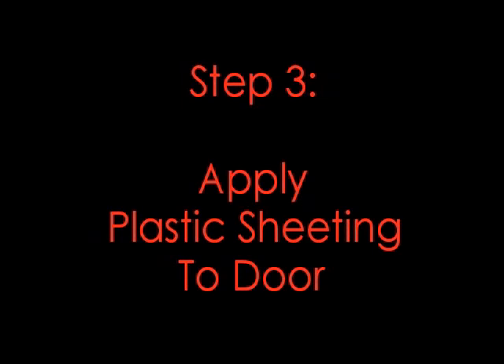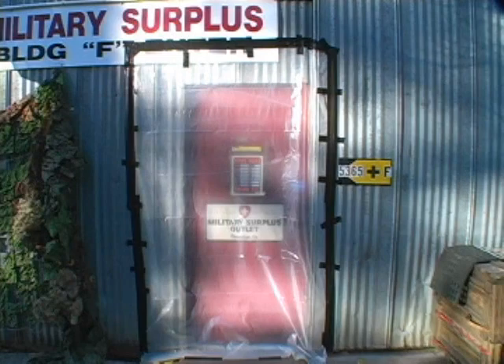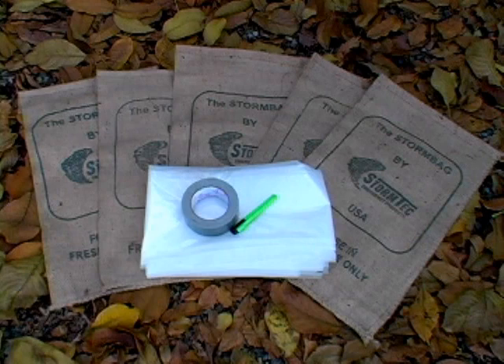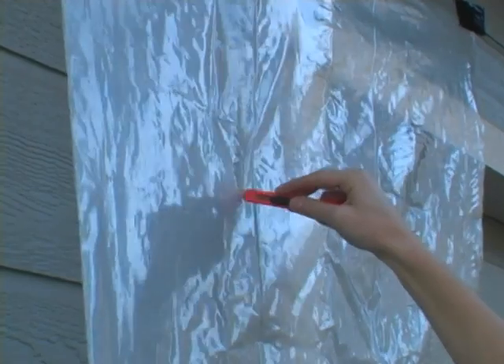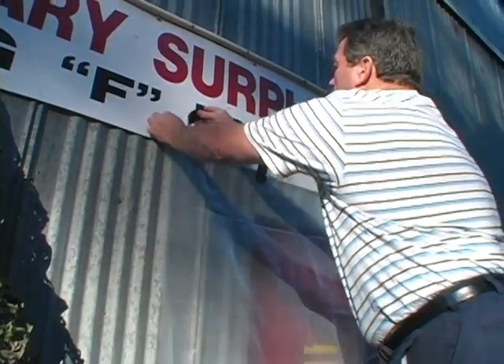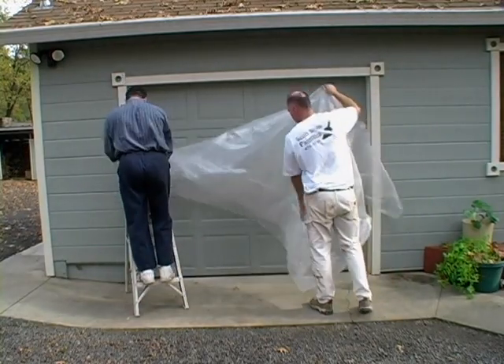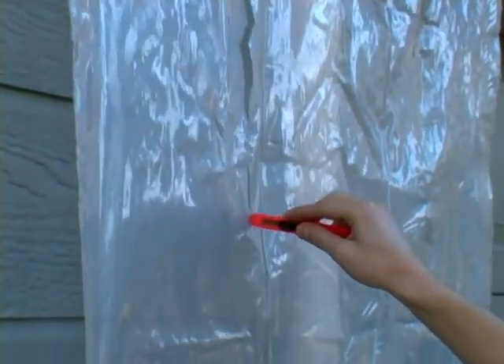Step 3: Apply the plastic sheeting to the door. While the bags are hydrating, you can apply the plastic sheeting to protect your doorway from wind-driven rain. There are different sized kits for single-entry doors and garage or roll-up doors. The sheeting in your Storm Tech kit is pre-cut to fit most standard doorway openings, but some modification may be required. The key is to provide enough overlap around the door edges to protect the entire door. Begin by unfurling the plastic sheeting and duct taping one corner several inches above and to one side of a corner of the door. Tape again in approximately the same place on the opposite corner. A second person and a ladder will prove very useful for this step. You may use the razor knife to trim off the excess plastic along the side if desired, leaving a several-inch overlap down the length of the door.